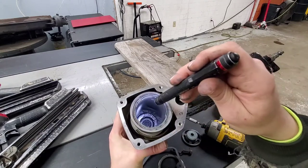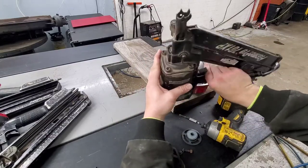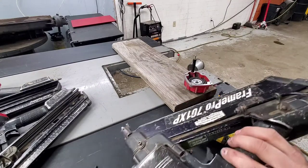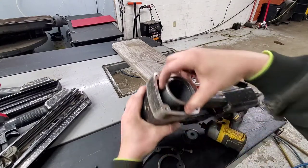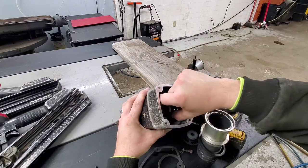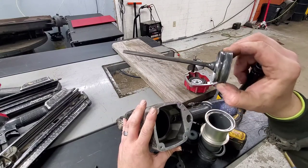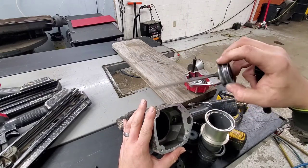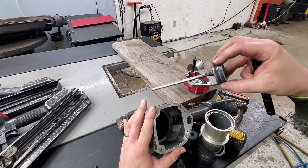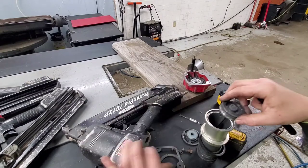This one here, he told us to go ahead and rebuild them if they needed them. I'm not sure here if this one's going to or not, but he's a pretty good customer. He normally likes his stuff to last for a long time once we bring it back, so it's actually looking pretty good. I'm not really seeing anything too bad going on with this thing at all. I mean, the piston was still staying sealed good into the cylinder.